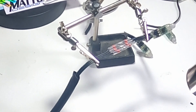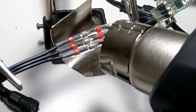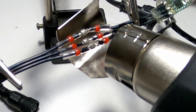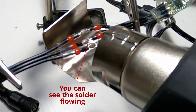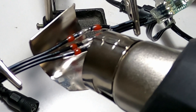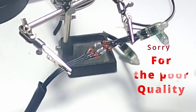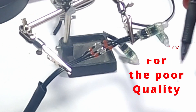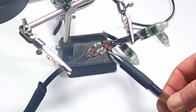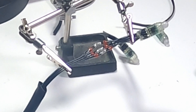I'm going to go ahead and heat this up — I hope you can see it shrinking. If you look, you can see the solder oozed out on this side and that side. You can see that the solder oozed out here and here, so the solder actually melted. The first one that failed just kind of went in and it looked like it closed, but no — you want to make sure it's sealed. You can see that it's sealed on both sides. That's basically the extent of putting it together.